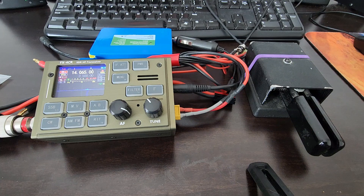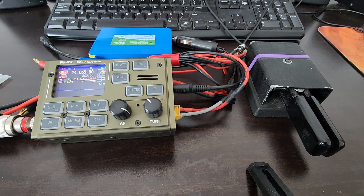With 20 watts — actually close to 24 on some bands. This radio puts out 20 to 24 watts on 10 through 80 meters, and 10 watts on 6 meters. Those are measured, not claimed values — 20 to 24 watts, which I really liked when I first measured this on the radio the day I received it. I thought, all right, this is pretty awesome: this small a form factor, 10 bands, and 24 watts out on CW.